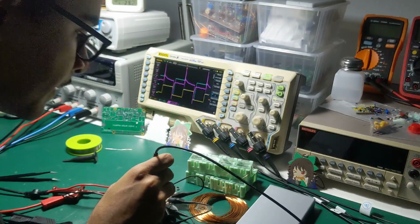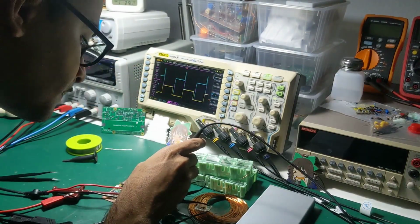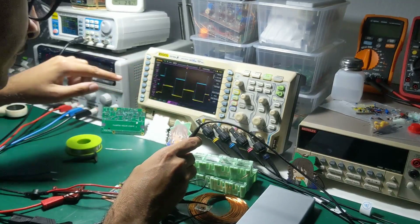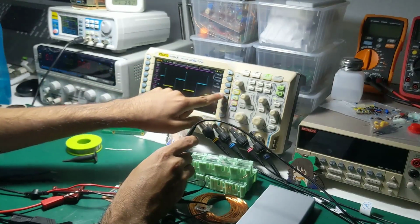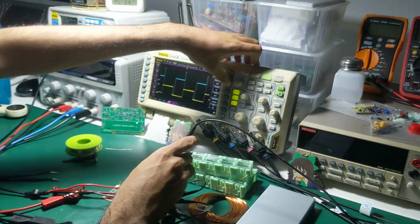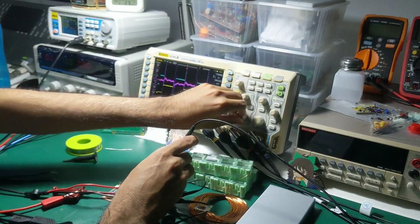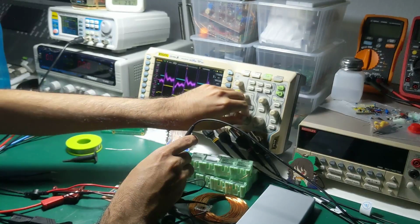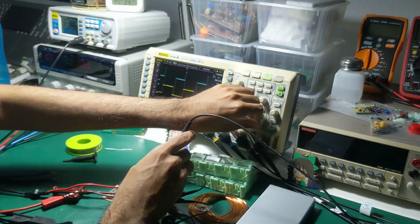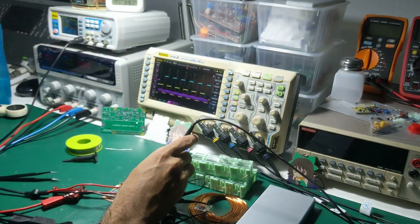I don't have power supply decoupling, and that's probably an issue as well. Just add a cap. Is it AC coupled? Channel 3. Bandwidth limit off. Coupling DC. Aha. This is bad. But if you look closely, none of this power supply crap really corresponds with what's happening on the output. So I'd say, yeah, forget about it. Although it's like 100 millivolts peak to peak.